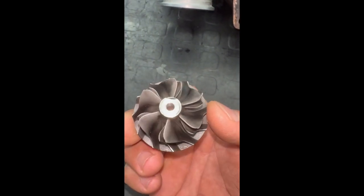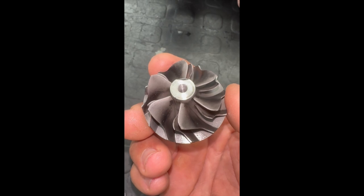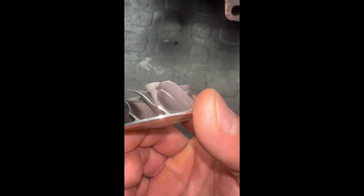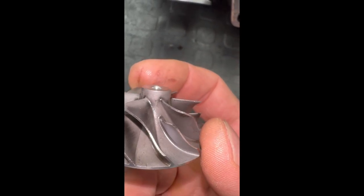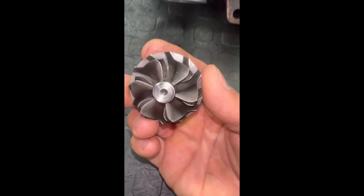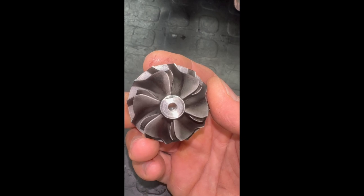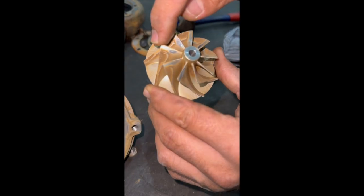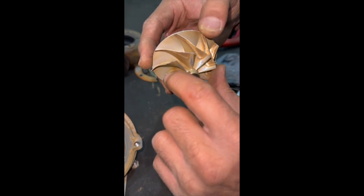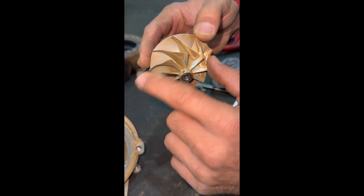I'll share some photos of a compressor wheel that has been exposed to heavy dust so you can see clearly what it looks like. Here is an example of dust ingestion — look at the corners of the blades, you'll see they're rounded, and you'll actually see the same media-blasted appearance underneath the blade. Look at the corner of the blade tip — that's where the impact is; it's the first part of the compressor wheel that comes into contact with anything that gets past the air filter. In this specific case that rounding hasn't happened — testament to the materials we use — however you can feel a slight roughness on the edge of that blade.